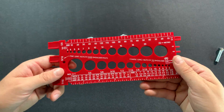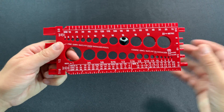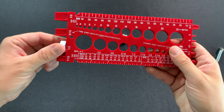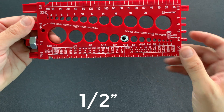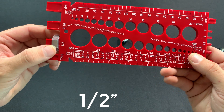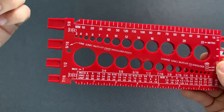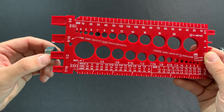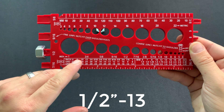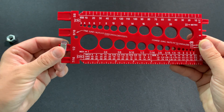Now I'm going to determine the diameter and thread pitch of these two nuts. Nuts are done differently — we don't use the holes or rulers, we just use the side prongs. I keep trying prongs until it fits on the first nut — it fits, and because it pushes all the way down, that tells me this nut is fine thread. For the second nut, which I already know is also half inch, it doesn't go all the way down — so that is a half inch coarse thread nut, which is a half-13. And the first one here is a half-20 fine thread nut.